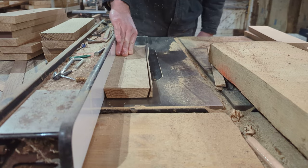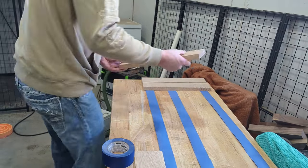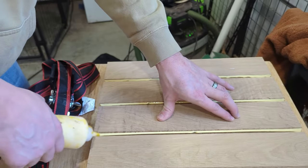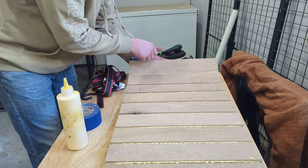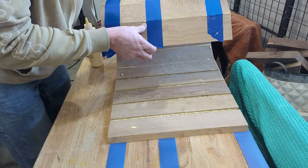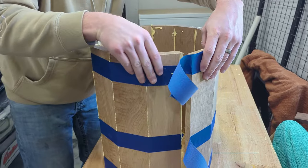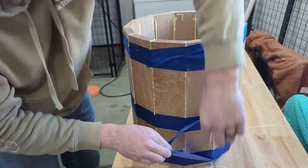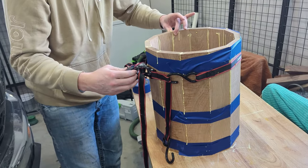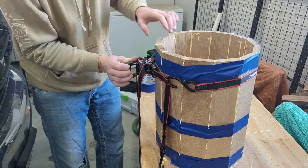This is way more geometry than I know how to do, but I was able to look up equations for what angle to cut for the diameter I needed — it ended up being about 13.8 degrees on my saw. I cut around 13 or so slats that both had a bevel on each side. I added a ton of glue to these, then used three pieces of blue tape to hold them together, making sure the top and bottom are both flush. I slowly start to fold these on top of each other, then paused to regroup and lift it up on its edge — the blue tape held really well. I used the excess tape on the sides to hold it in place, then ran to get a ratchet strap, put one on the top and bottom, and slowly started adding tension, which applies even pressure all the way around. I was getting good glue squeeze out, and this turned out much better than I thought it would.